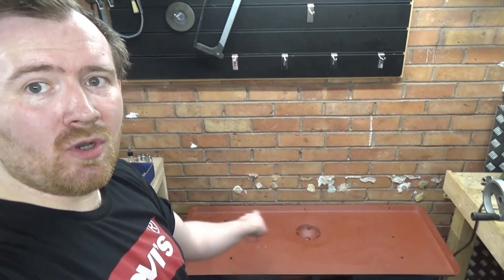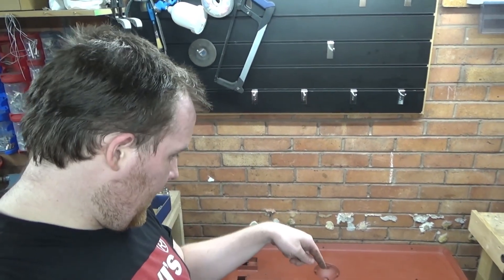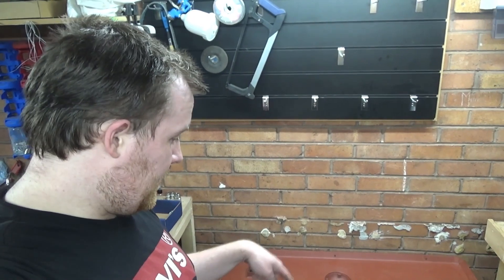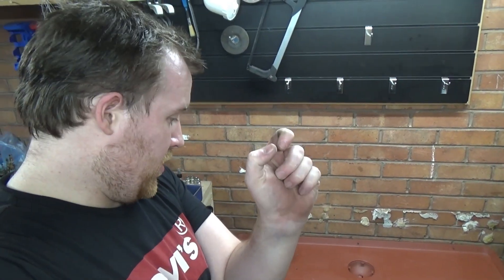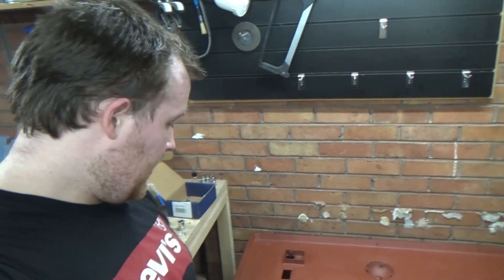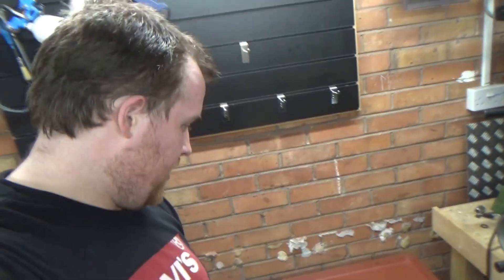That was actually lucky because the two front ones came apart - they were in the wrong place anyway. Luckily when I lined the back two up, the stand had actually moved a bit further back, so drilling new holes they've actually sat in the right place. Third thing is: when you're hitting these in, the ends actually mushroom over to a point where you can't get the nuts on. I've leveled it as good as it can be - I'm not a chippy or anything, so I've only got these magnetic levels, but everywhere I've tried the stand it is level.